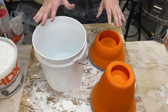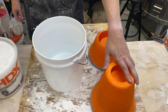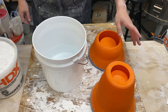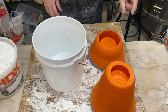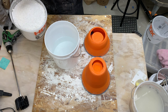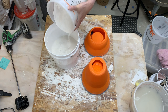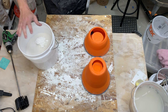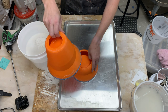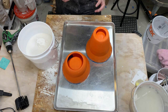The software calculated how much plaster is needed. This one's a little under 2.25 liters of space and this one is just under 1.75 liters. So I'm going to mix up 4 liters of plaster — that should give me about a 5 to 10 percent margin. I've got all that measured out. Let's go ahead and mix the plaster — first to slake it.